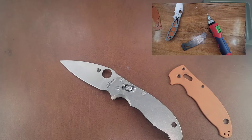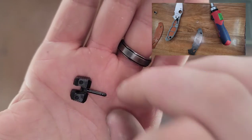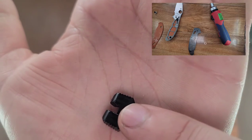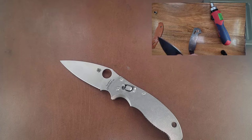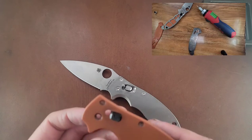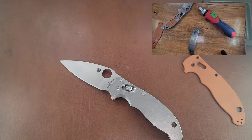So I took that out, and then you also have this detent cage — this looks just like the one on the titanium, it's the same exact model but in G10. Notice they're different: this side has a little lip that rides a little bit higher than this side. This is where the ball goes, and it actually sits in your knife so that the open face of the ball is riding on the backside, not the front. So the opening for the ball goes towards the back so that it's riding on that backside of the cage — just for clarification, for those of you looking for that.